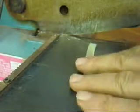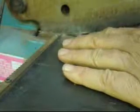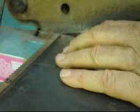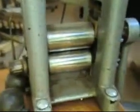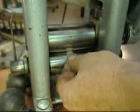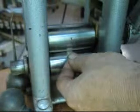So basically come in, and this is a great old shear. I bought it, probably 20 years ago. It's built to cut 1/4 inch steel. So a little piece of 16th inch silver is nothing for this thing. So we'll take this and we'll move over to the rolling mill and see what we can do there. The piece can go in there. We have to get the mill opened up enough to accept the piece.